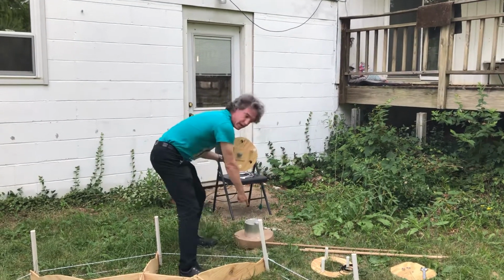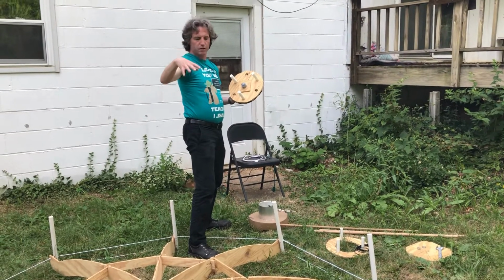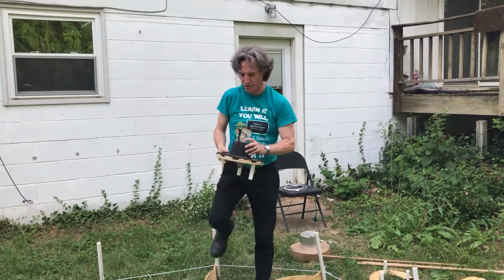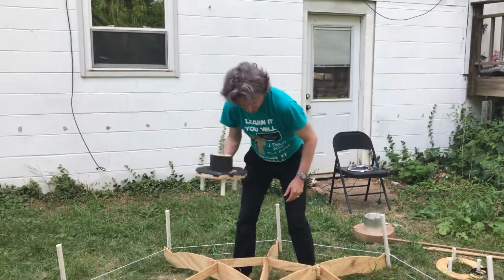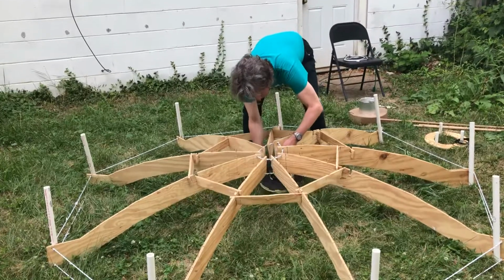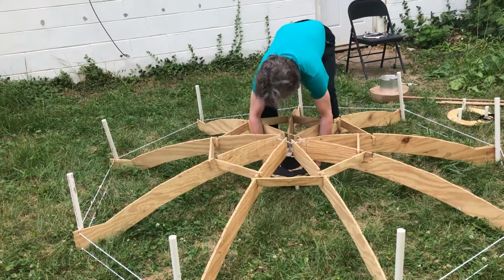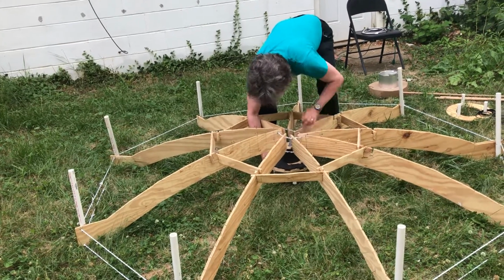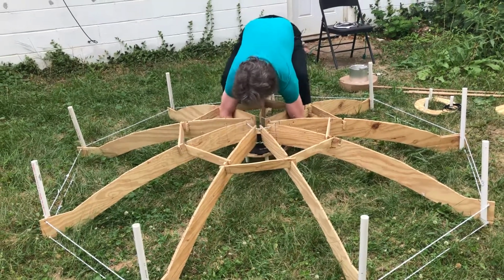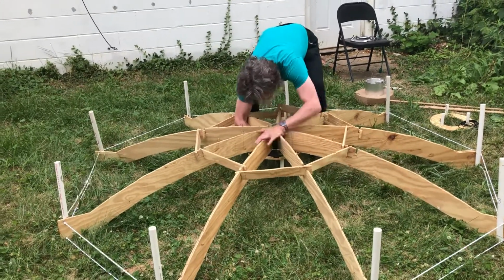And then the feed fits right over the focal assembly ring, and when it's assembled, the feed will be exactly at the focal point in the optimum position to receive signals. So I've got to pull this underneath and position it in the center, and then I kind of push the ribs out so that they fit over the foam, and then I just push them down into place.